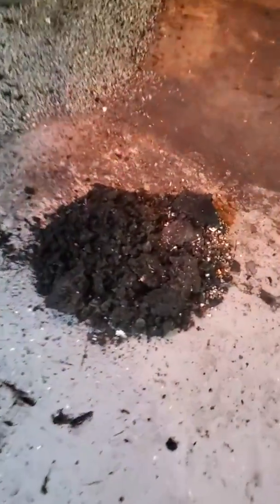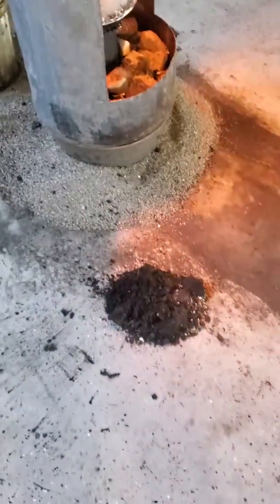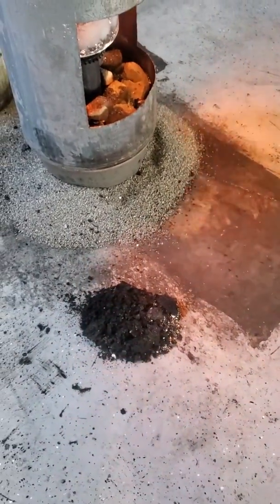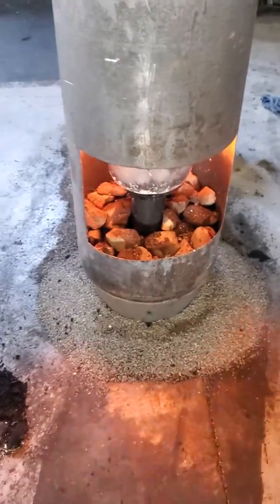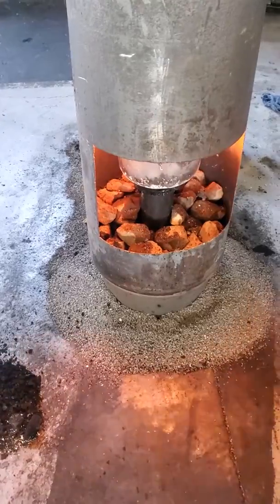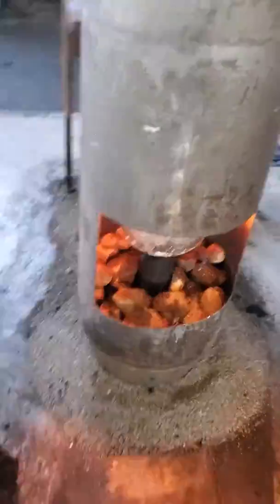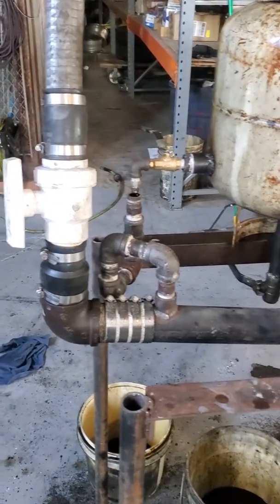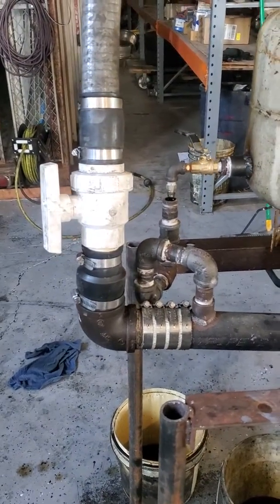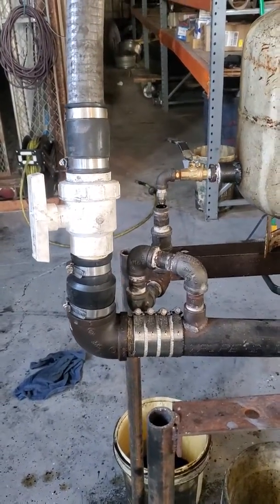It does produce a little bit of residual waste in the burn bowl. At the end of the day you just take the burn bowl out, turn it over, slap it on the concrete, and the debris falls out — then you're ready to go again. To light it, I just put a little gasoline in for the first light, then add oil, turn the fan off temporarily while the gas heats up the oil, and in about 10 seconds you can turn the blast air back on.